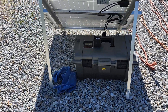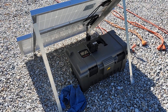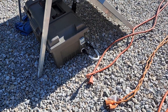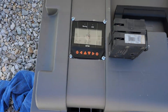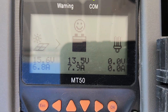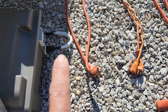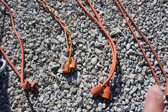We're looking at my completed power station here. We used this for the other tests on wire size and we're gonna do basically the same thing — unplug the power station and plug in cords in place of the direct connection to see what kind of losses we get. As it stands right now we are bouncing back between 7.9 and 8 amps. That's our baseline and we're gonna go in order: 50 footers 12 and 16 gauge, then 100 footers 12 and 16 gauge.